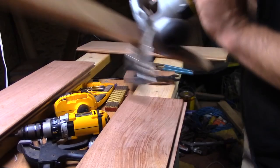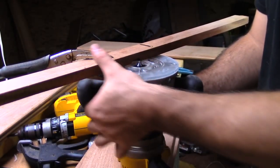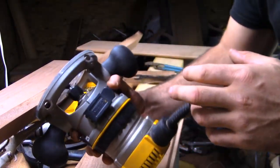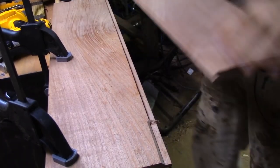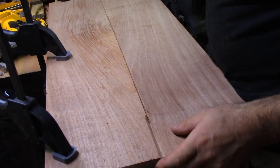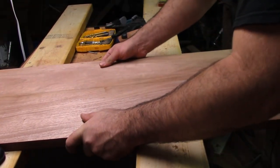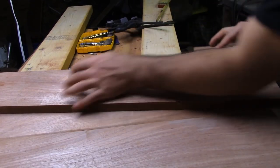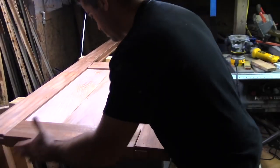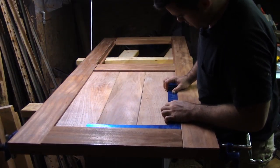The tongue side is going to be a pain in the arse — straight up the most difficult thing I've had to do on this whole project. Since this router bit has a bearing on it and the depth is set to a certain point, it won't work when I do my routering on the tongue side. So I'm going to set up a table. Since I don't have a routering table, I'm going to fasten a base onto the bottom of my router so I can make this cut. I put one screw in it, threw the plastic into this, and used a set of vice grips to clamp it down to the fence after getting it to the correct angle. This took forever to set up. I just messed up on that piece royally — that's going to be a pain to make disappear.